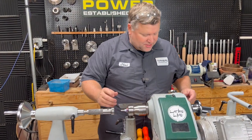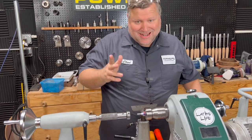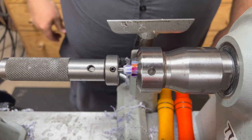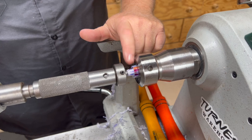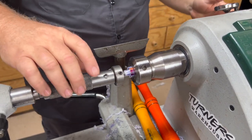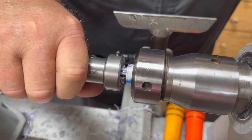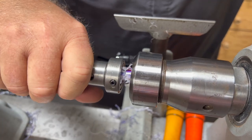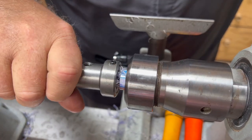This is the most delicate part. I'm going to put a little bit of WD-40 on here and a little in my die. You want to be really careful because you can easily snap this off — and it will happen. So don't be alarmed when you first do a couple of these. I'd take some old blanks you don't mind ruining and practice this process first. I'm going to introduce this up until it touches, then gently spin it forward. You can see those curls coming out — I'm giving it slight pressure as I spin. I'm spinning both the lathe shaft and the die, and then I'm going to back it up. Those should cut loose.